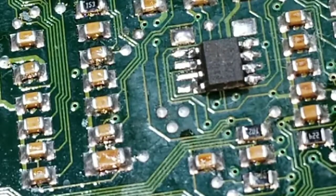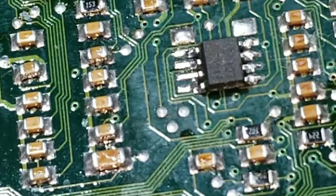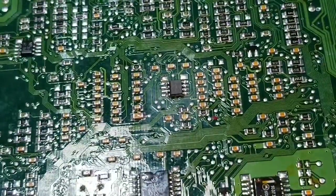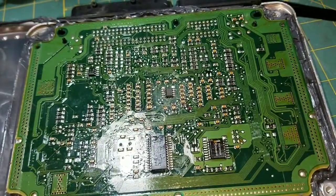It's literally a five-minute job if you want to put a used PCM in a MK4 Jetta, Golf, GTI, or similar. Most Bosch computers — if you flip it over and it has a security chip in the center — you can switch them over real quick and save yourself the time and headache of trying to get the pin number out of a used PCM. Thanks for watching. I'm going to clean this up, put the cover back on, seal it up, and put it in the car.